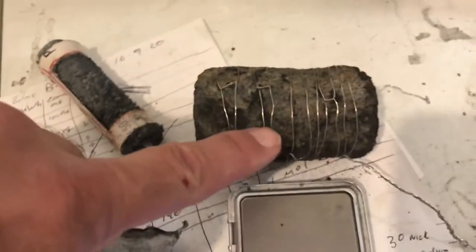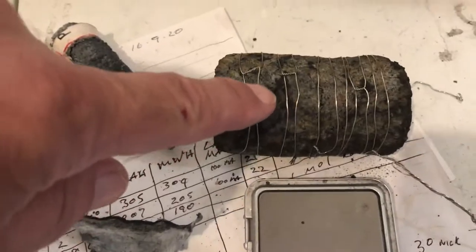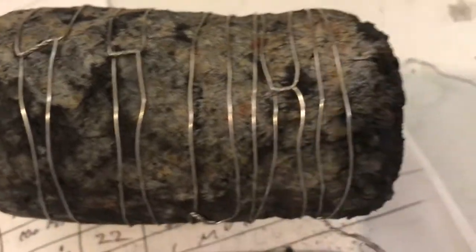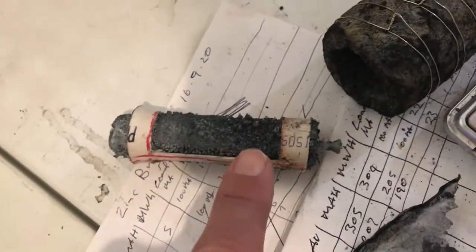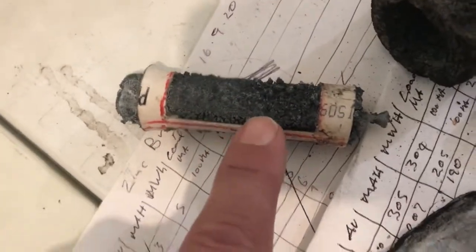I've got around about 2 meters of nickel wire, which is 0.4 mil in diameter. I decided to wrap it multiple times, and from that end there to the inside edge you get around about 1.4 ohms, which ain't too bad, I guess. I'm going separator-less with the negative electrode, which I've plated.